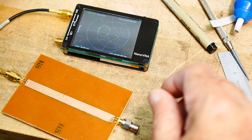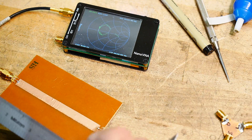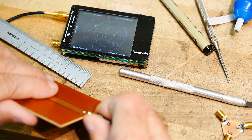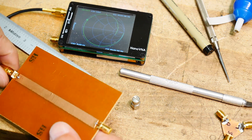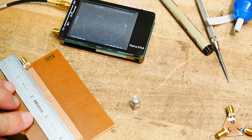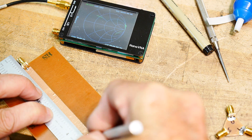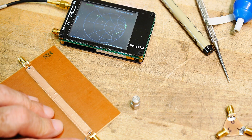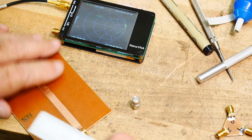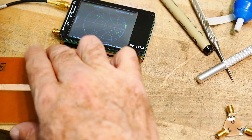So let's go ahead and remove some width. Let's use a ruler to be more exact. The connectors are in the way, so let's get rid of those. I will surgically remove some of our microstrip width. We removed 50 mils — sorry for the metric viewers — but anyway, we made it smaller. Let's see what that did.